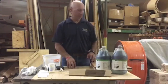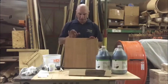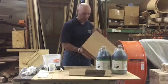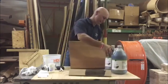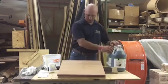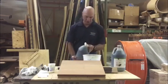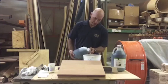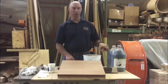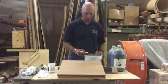We're actually doing this on a Brazilian cherry sample — what I call a three-board sample, which is two pieces of Brazilian cherry and two more in the center showing a joint. I like to show joints on my samples. I'm going to take the iron acetate and apply it to this Brazilian cherry using a foam brush, dipping it into a small pot of the solution. When this iron acetate solution is used it looks clear, but if you let oxygen get to it, it will start rusting the steel components inside the solution. It doesn't make it bad that it looks rusty, but it's unsightly on older iron acetate finishes.